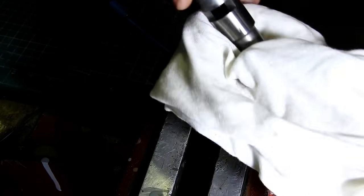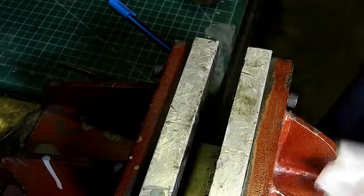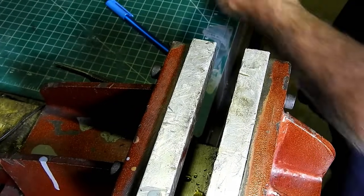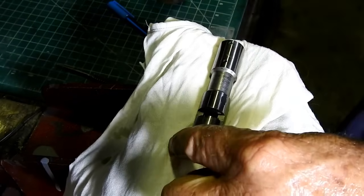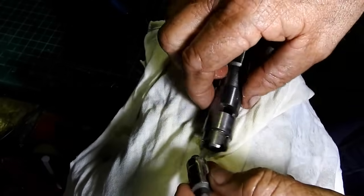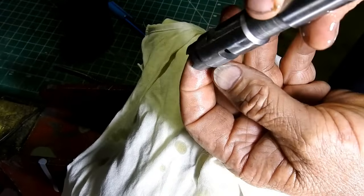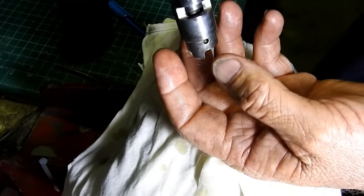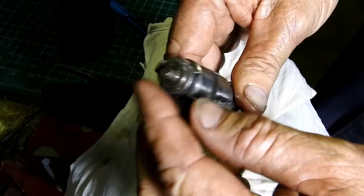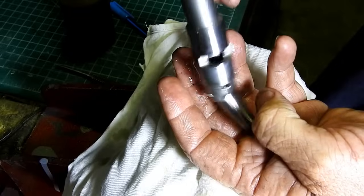I've gone and cleaned this valve up - used a little bit of 600 paper just to make sure there were no little bits and pieces in the way. We'll put a light smear of oil down. I'll put a piece of rag here just to keep everything clean. The valve here - we drop a smear of oil there. That's what we want to see: we don't want it stuck, but we do want to see it move under its own weight. It just slides in and you can see it disappear under its own weight - so we know that's nice and free.